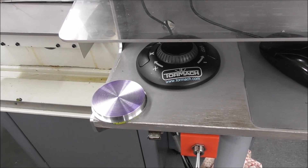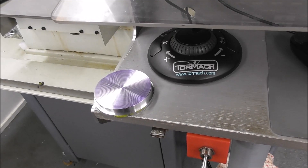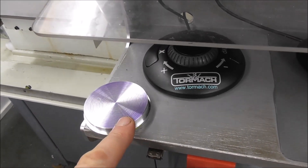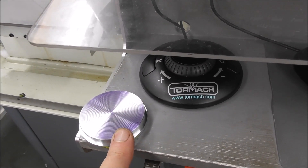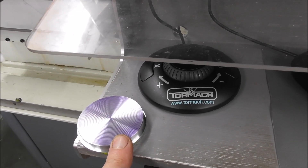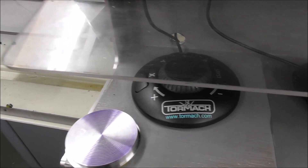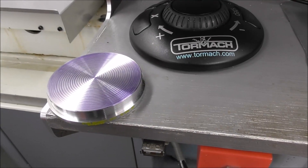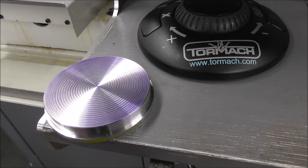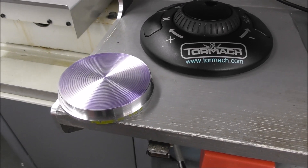What may be happening when you get a pause or hesitation and then an increase in feed rate across the face is that tool pressure and tool spring — which you always get some of — allows the tool to dig in slightly when it slows down and to flex away slightly when it speeds up. The fact that it's a very even pattern makes me think it must be something to do with the feed rate, encoder feedback, software circuit.